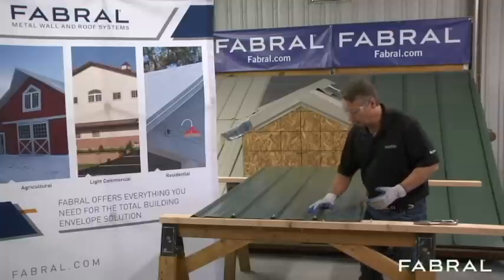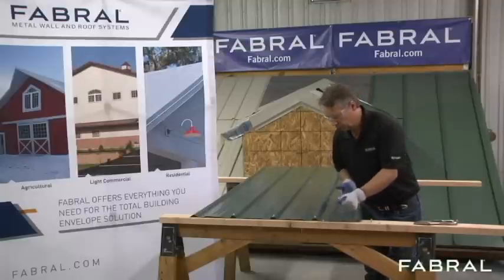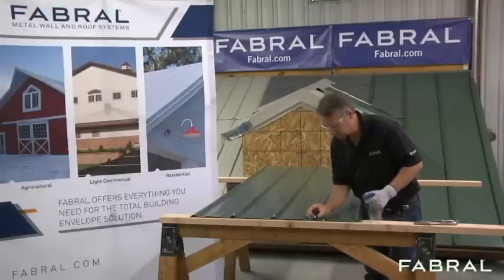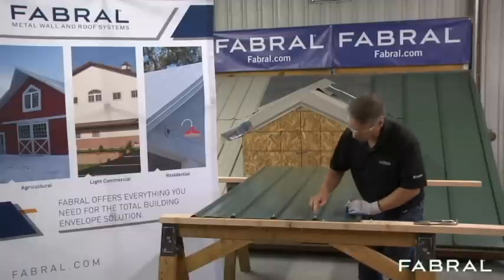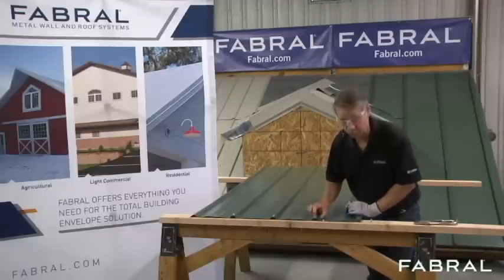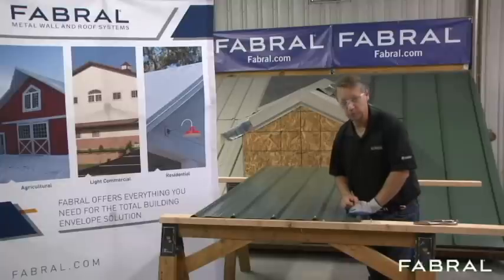Another reason: we don't have a complete seal on the washer because the very top of the rib is not as wide as the washer. One of the biggest reasons is that when we have the screw on top of the rib — the rib is three quarters of an inch high — the head of the screw is going to be sticking three quarters of an inch up out of the substrate.